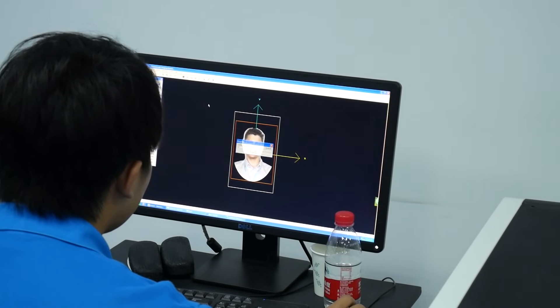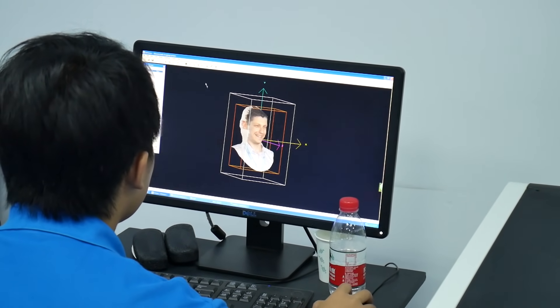So if your custom glass cube has really sparse dots, they were probably cheaping out on you. The images used in these systems are either JPEGs which are 3D-ified using special software, or a mesh file similar to what you might be used to in 3D printing. However, unlike 3D printing, you don't need to have a manifold perfect watertight mesh — you can use pretty much any mesh file you throw at it, which makes the post-processing aspect of running these machines actually quite low. You just take the mesh, crop it, size it, and position it, then let the software turn it into dots and send it into your glass cube. There's actually an awful lot of science that goes into the behind-the-scenes creation of these shapes — for example, if the dots are too close together they can form what's known as a clash, where there's an internal crack between the two dots. So the 3D dots are specifically layered to avoid a chance of this happening.